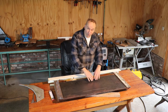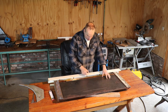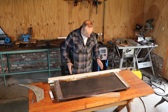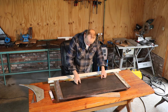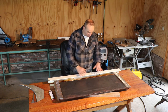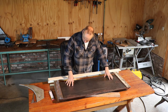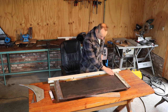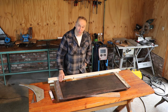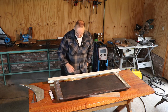With the root ripper I had a very strong interface plate in the middle with one backside stiffener. Now there are multiple rakes, so now I will have two backside stiffeners, making a very distributed stiff construction attached towards the welding plate, which is attached towards the front loader. To protect the interfaces of the Kubota, I will also add a front plate. It's not so much for stiffening, but more to protect it from dirt and other stuff getting towards the interfaces.